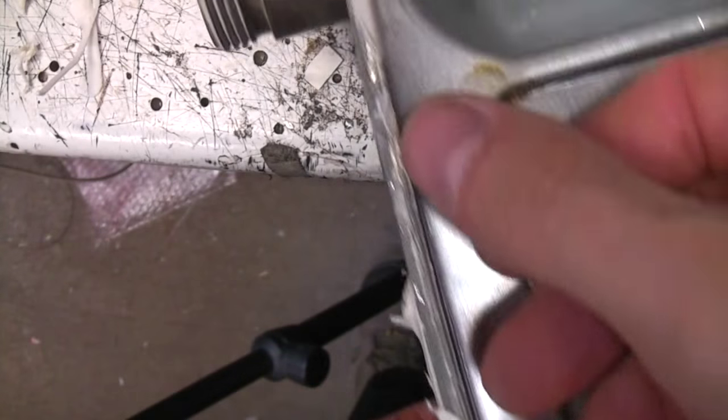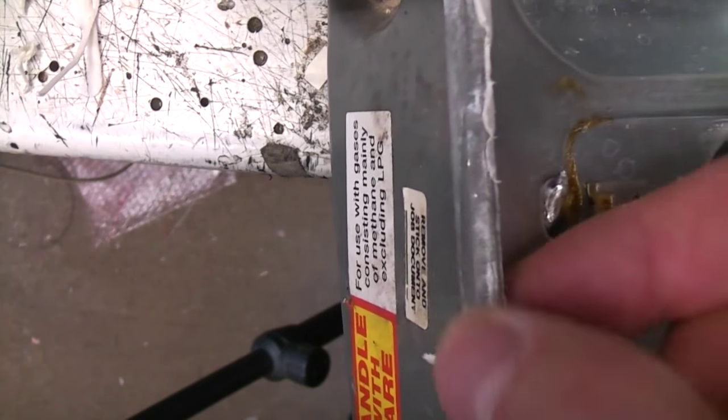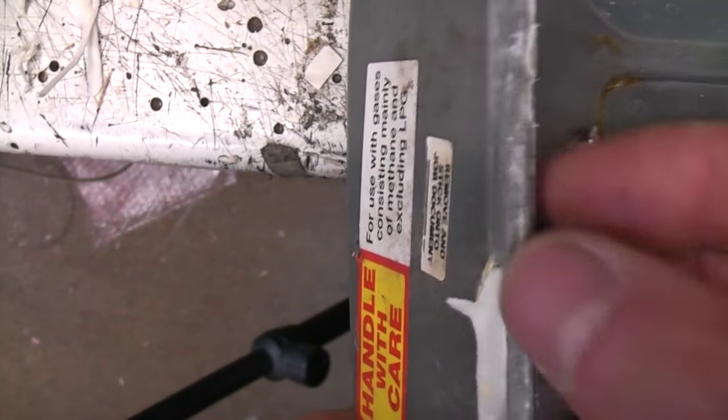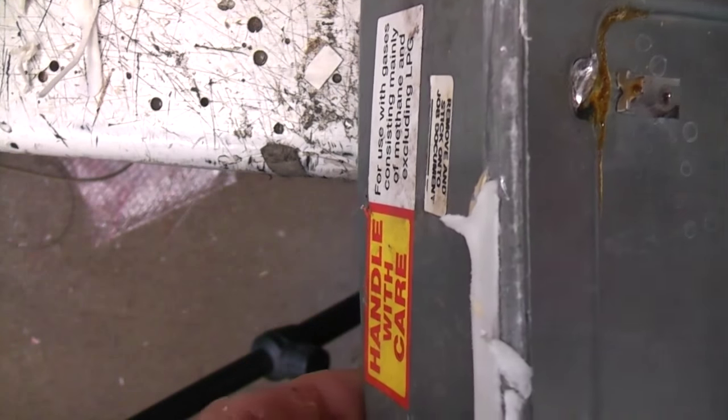The display is connected straight down to the NEC chip and nothing particularly exciting there. We've got the actual feed-through to the gas. I don't know whether this is the whole transducer assembly or just a gas-tight feed-through to parts distributed inside the gas enclosure. The seam on this appears to be soldered all the way around so we're going to have to hack that. I think what I'll do is try and cut it - because the solder's quite soft it might be possible to cut it and then peel some of it without cutting the whole thing off.